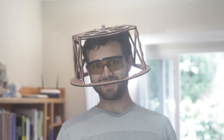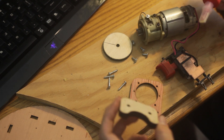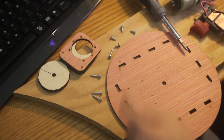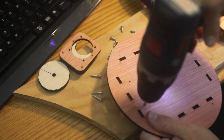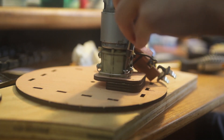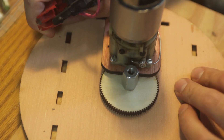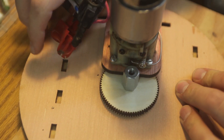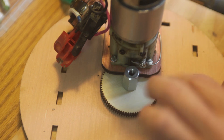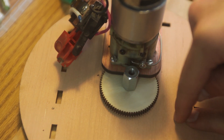The mounting bracket for the motor is going to be assembled, and to do that I'm going to glue these two laser-cut pieces together. I've encountered a potential problem — the motor stops very abruptly, and what that's going to do is rip the teeth off the gear since the pumpkin will want to continue spinning. So what we can do is create a friction clutch where the gear is not rigidly bonded to the axle that is spinning the pumpkin.